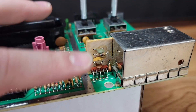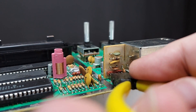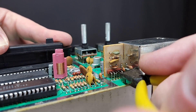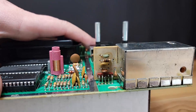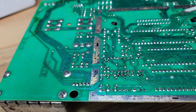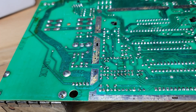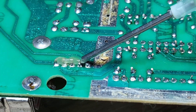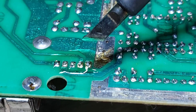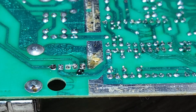Moving on, it is now time to remove some of the stock Atari video circuitry. These five legs will need to be clipped and then desoldered from the board. To make desoldering easier, it's best to clip these legs just before the 90-degree bend. If you cut them too short, it makes removal difficult. Now using a pair of larger needle-nose pliers, we'll twist and break free this portion of the circuit board. Flipping the board over, we will now need to begin the process of cleaning the solder and removing the five pins that we just clipped. Here I'll add flux to the area to assist with solder removal. It's important to use caution and be patient — if you don't allow the solder to melt before pulling on the pin, it's easy to remove the pad from the circuit board. If this happens, you won't have anywhere to solder to attach the new wiring.